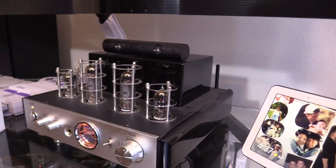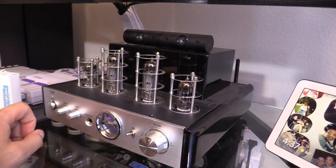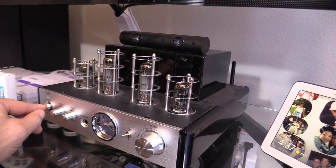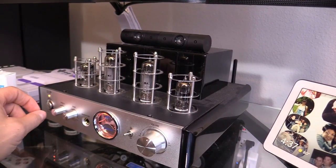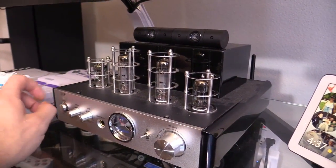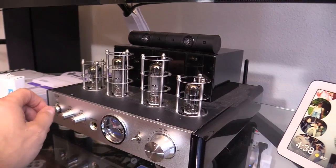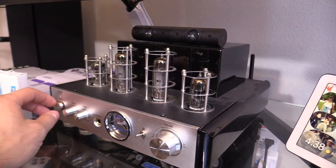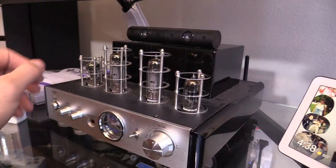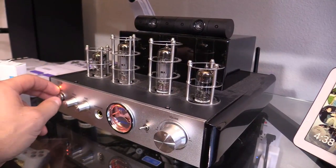I'm going to show you how to find out. When you first turn on the amp, the tubes take a while to warm up. This is a hybrid tube amplifier, so when I turn it on the hum kicks in about 30 seconds later. If I wait maybe 10 minutes while these all cool down and turn it back on, the hum will kick in after about 15 to 20 seconds because the tubes activate and warm up right around that time. So if I get that hum after 20 to 30 seconds, then I know it's a tube.